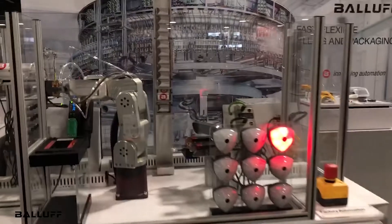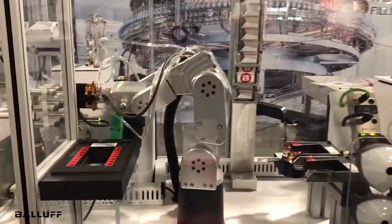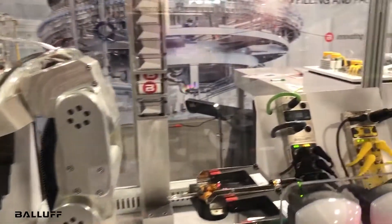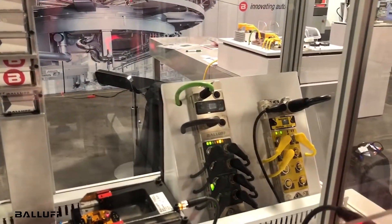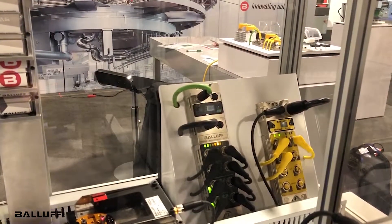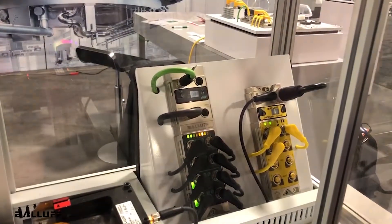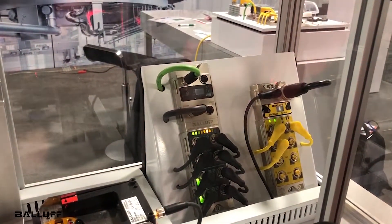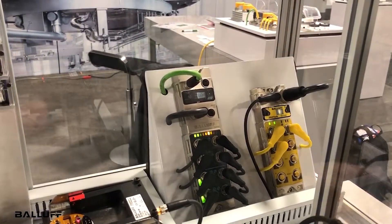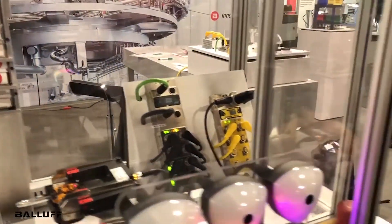In this demonstration, we have a robot with a couple different functions that the robot is operating off of. We have our IO-Link network and interface, a master block connected to a PROFINET network, and we also have our safety hub, our PROFISAFE hub, that is connected into the master block. You can start to see in the robotic work cell there are a lot of different safety requirements and safety devices, and we can engage and connect those through IO-Link.